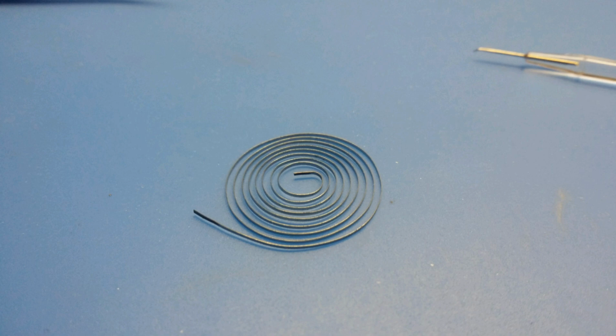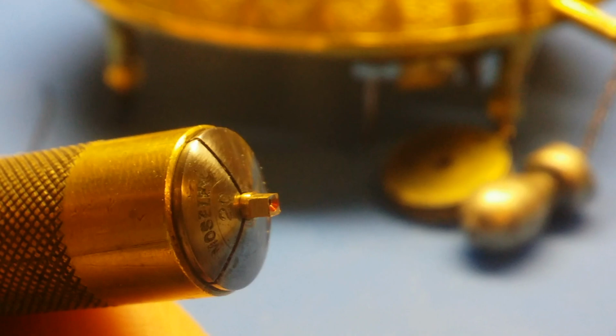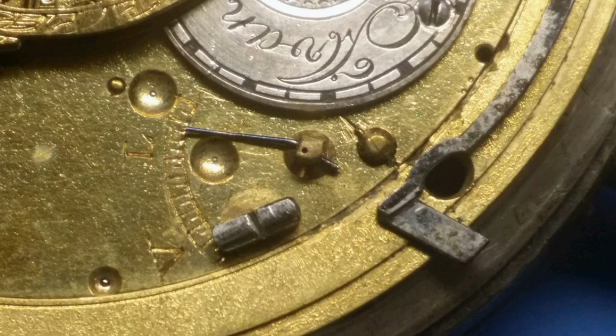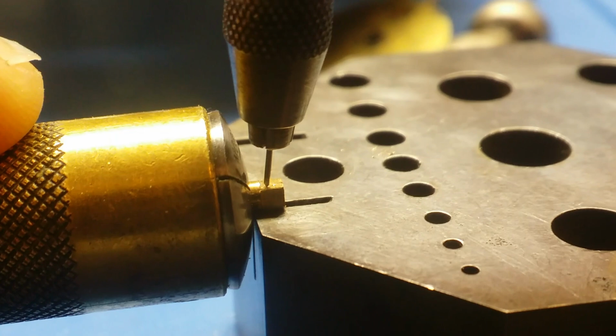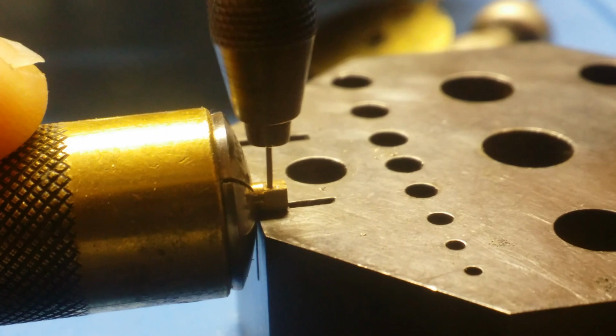And the last thing that I want to show you is a little marker that I needed to add to the eccentric bushings. Now, this is the last bushing or gear in the alarm and repeater mechanism. Using a fusee pocket watch of similar vintage, you'll note from this picture here that the marker that they use for regulating the speed of the repeater or the speed of the alarm is simply a piece of blued steel wire or maybe a tapered pin that was put into that eccentric bushing and bent slightly so it interacts with the scale there from slow to fast.